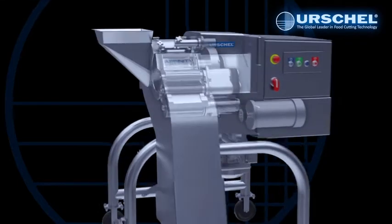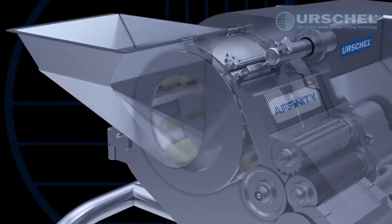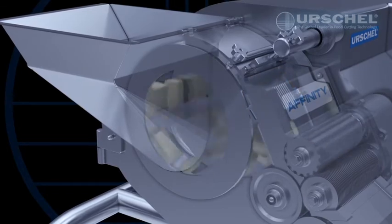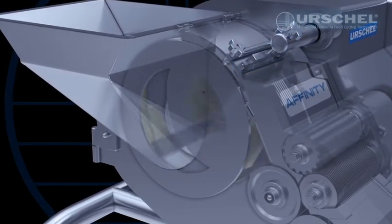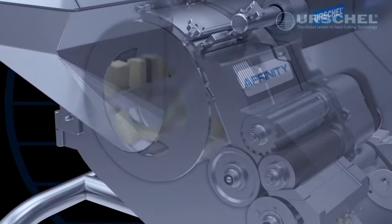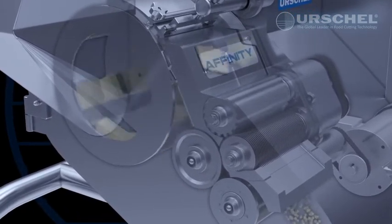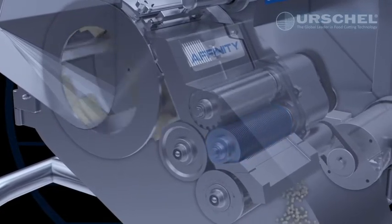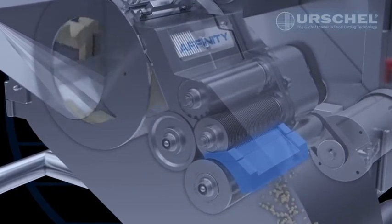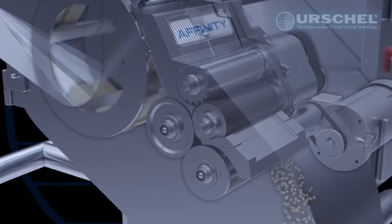Inside the food cutting zone, product delivered to the feed hopper enters a rotating impeller. Centrifugal force holds the product against the inside of the case. The impeller paddles carry the product past the slicing knife. An adjustable slice gate at the top of the case allows the operator to set the slice thickness. The accurate slices pass between a rotating feed drum and feed roll before entering the circular knives. The feed drum maintains positive feeding of sticky and moisture-rich produce. The circular knives cut the product into strips, which pass directly into the cross-cut knives where the final cut is made. A stripper plate removes product from the spaces between the circular knives and acts as a shear edge for the cross-cut knives. Finished product then exits the discharge chute.